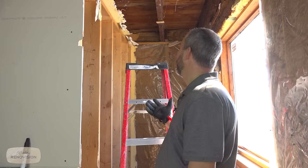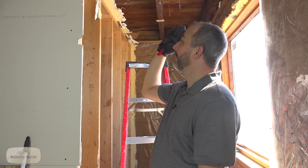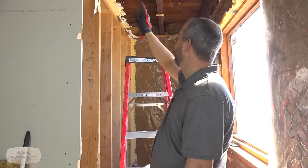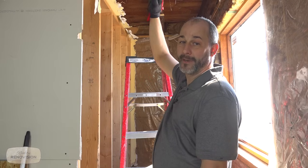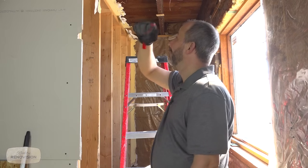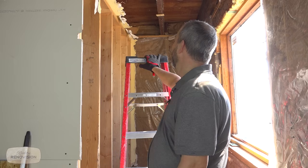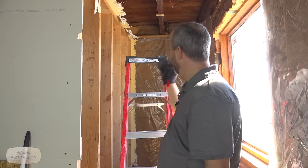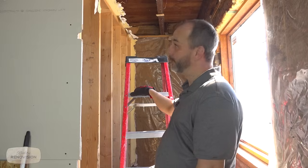So the system here is real simple. Make sure your wall is level, and then find the point directly above the plate of that wall where the floor is, drill a couple holes. He's gonna put a 2x4 on the floor up there, screw it down, run the saw down that, and then before you know it, we're gonna have a great big hole here. And then we will build a couple of platforms and start throwing in some stairs. Hoorah!